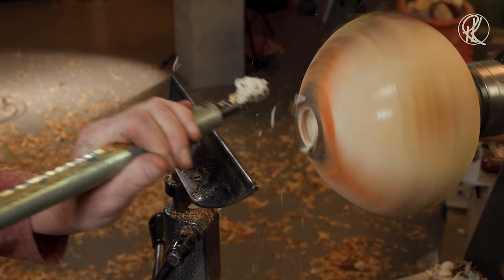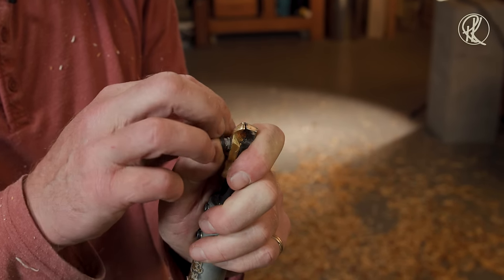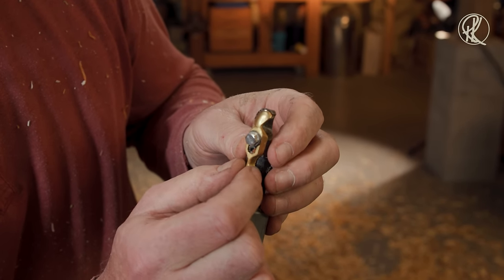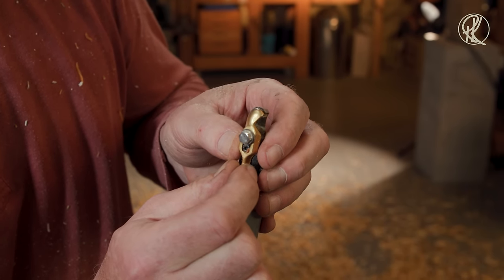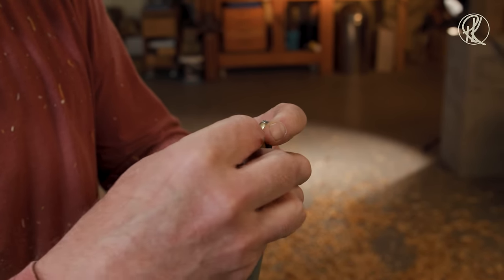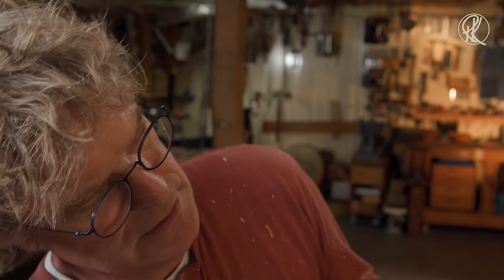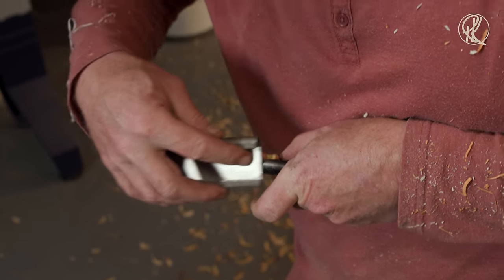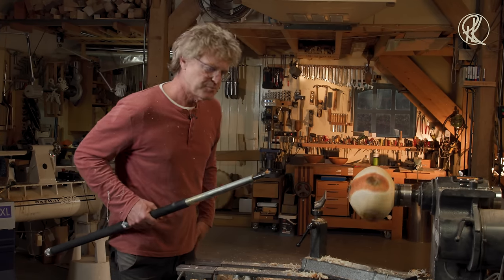Well, this one was used in a course, I know for sure. And the nice thing about these Woodcut ProForms is that you can decide yourself how aggressive you want it to cut, by moving the shavings limiter. Let me have a nice and aggressive cut, because we don't have all day. And while I'm here, let me give it a quick sharpening. Let the boring process start.